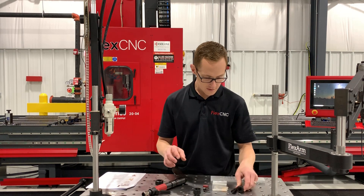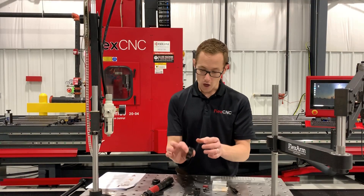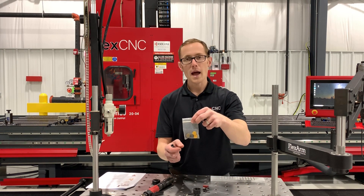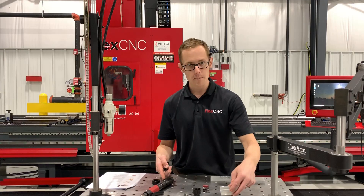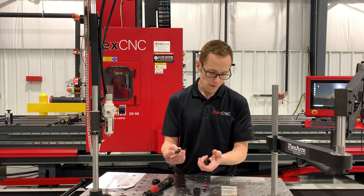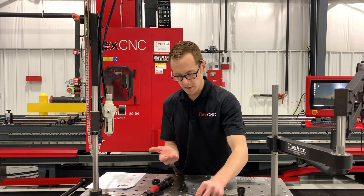Next, this is an example of a front end assembly — this is a 3/8-16 front end assembly. This is our nozzle. This is the mandrel, and each one comes with a bag of cushions and spacers. The cushion goes into the large adapter and it helps cushion your mandrel, your driver. And then there are different spacers here for setting my depth.